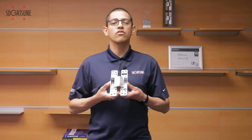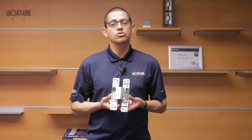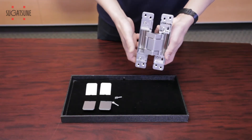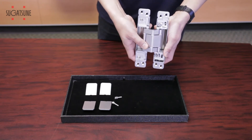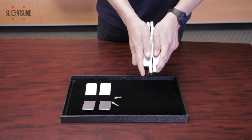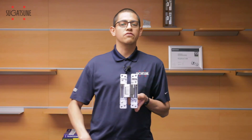A great feature that all of our HES3D hinges have is that the flanges do come apart, allowing you to install them beforehand, only needing one person for the installation. There are tabs that hold the hinge in place so the door doesn't fall off while you make your final fasten.